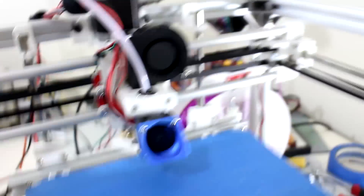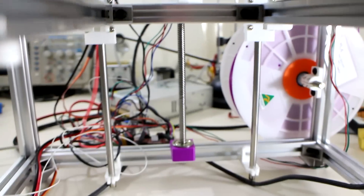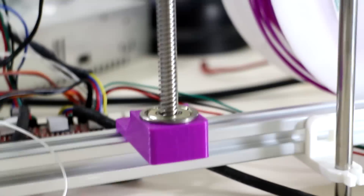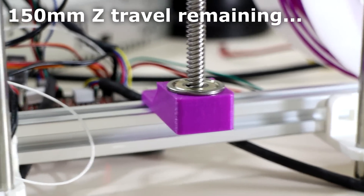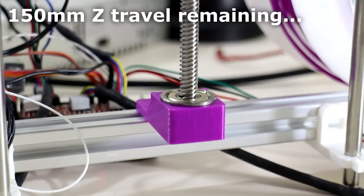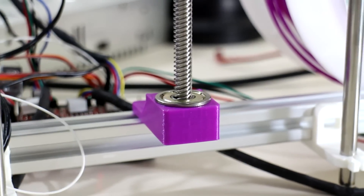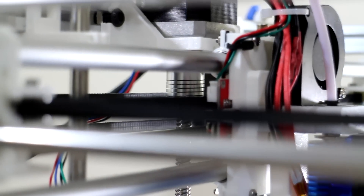On the Z axis, I was also on 170mm. As was mentioned in the comments, I've had to include a bearing on a new mount for the whole Z axis and build platform to rest on. The first prints I was doing — calibration cubes — showed a lot of Z axis artifacts. It turned out it was just the springiness of the coupler not centering properly after every homing. Adding that bearing block at the base solved that problem.